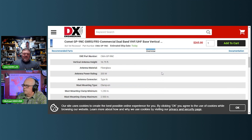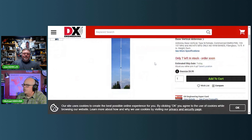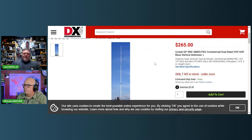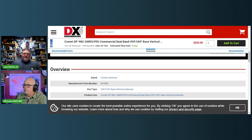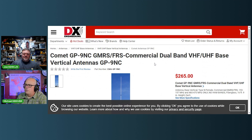What's the max power on GMRS for a base station? 50 watts. Are you going to see a $200 difference in performance? Marginal. It depends on your terrain and what your area is like. For home use, $30 versus $265 — I know where I'm going to put my money. Put your money in better feed line. Cut your losses down.